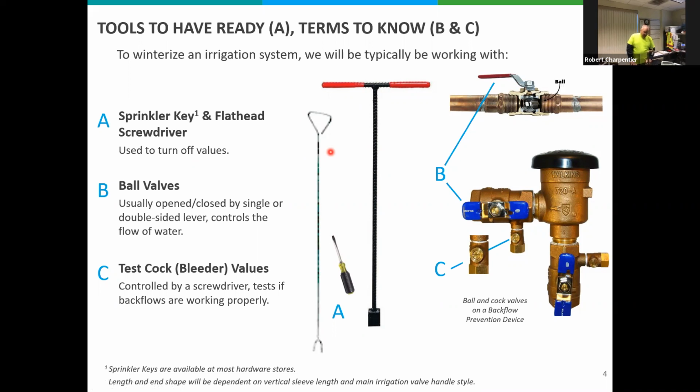The other key, with the red handles, is much heavier duty. A slot valve is designed more for a ball valve or what we call a stop and waste valve. It's got a slot at the bottom. Coincidentally, these will usually fit on the Truckee Meadows Water Authority cutoff valve on the street side of the meter in an emergency. Good tool to have, but you may need one of these.